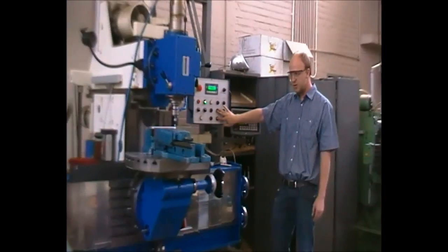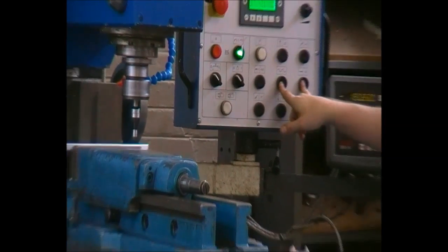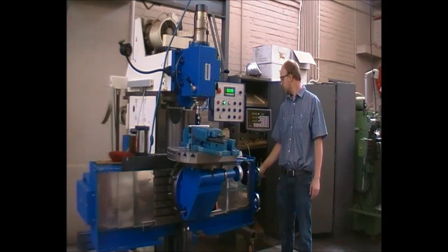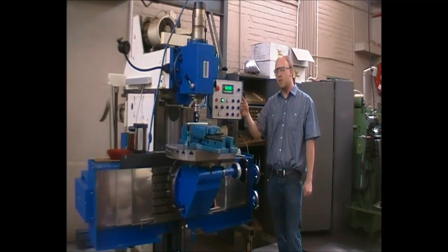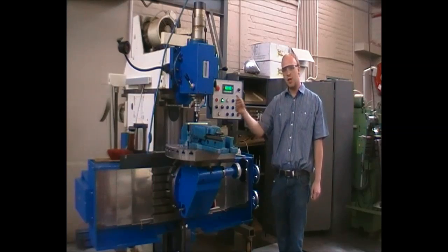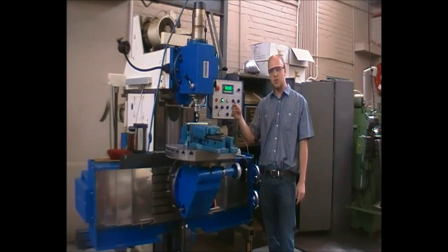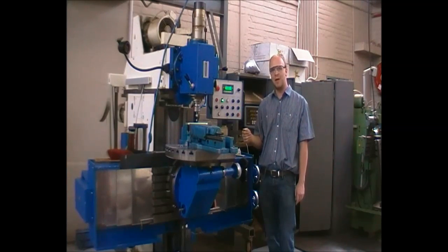If we move down and reach back to 100.4, we know this to be the true center zero of this part. This is significant — if we wanted the part to be 200 millimeters long, it can be seen the part was actually 0.4 millimeters over size. Please take note of this and decide whether the center or an edge is important for your project. This can be done in the Y-direction as well.